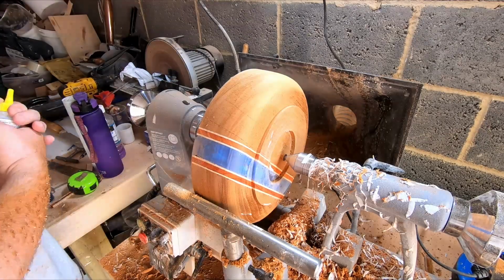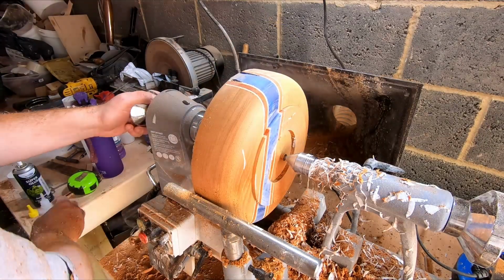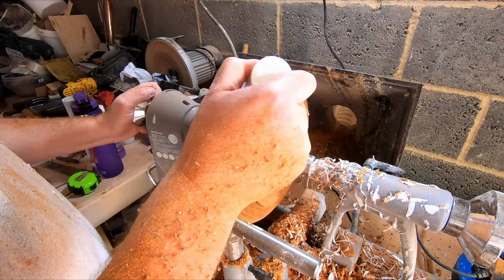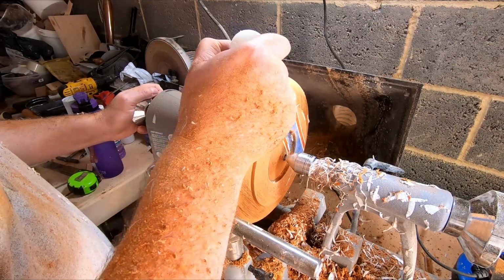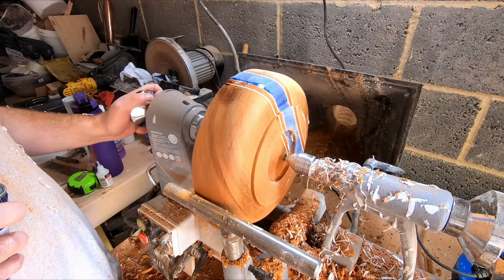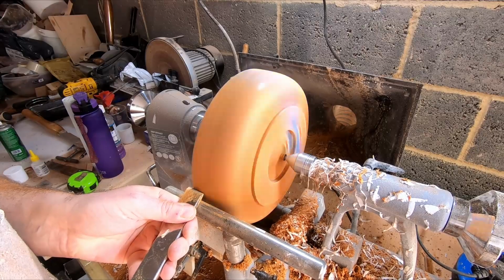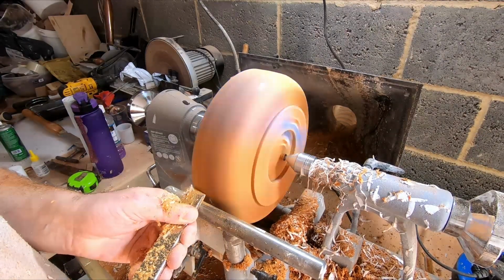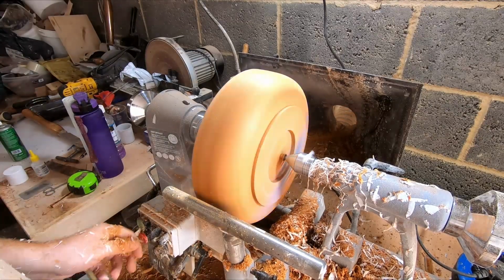There were some bubbles that formed and I needed to fill them. I think the wood had some moisture in it from the glue up, and this bubbled the resin as it heated up and cured. A lesson for next time, I think. The skew chisel removed the excess glue and then I sanded, this time from 80 to 400 grit.